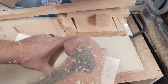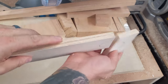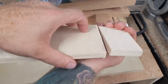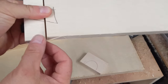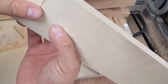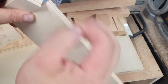This is some birch — or maybe maple — half-inch plywood. You can see we got some tear-out on that one and a little bit of tear-out on the underside. Now the other side — much cleaner. We did get a little bit of tear-out there, but there's no tear-out on the bottom, and on the back side just barely any tear-out — same thing, just one little pass of sandpaper is going to take care of all of that.